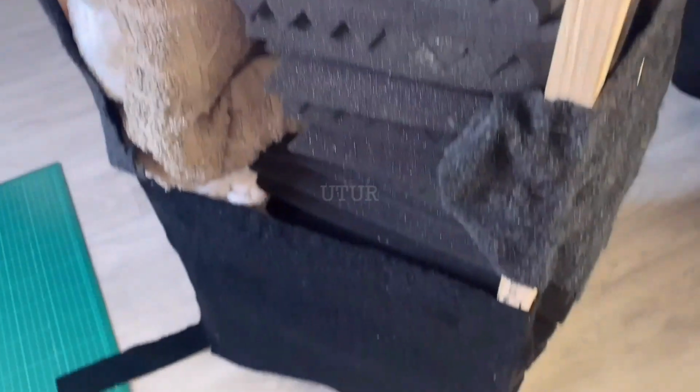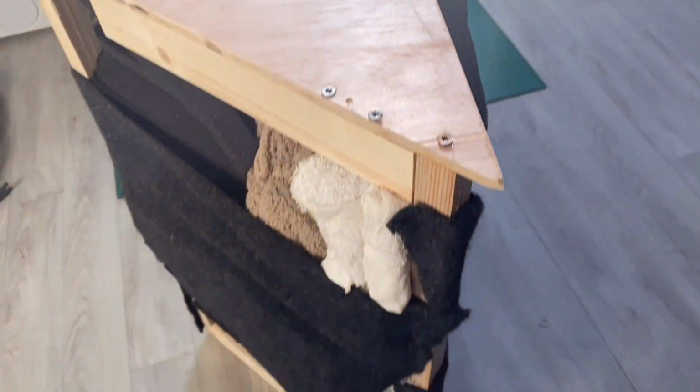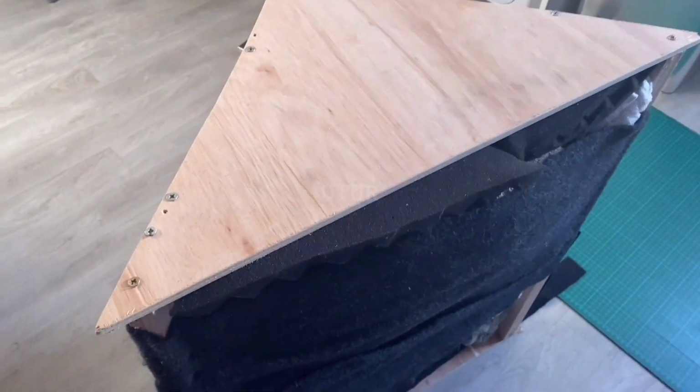And lastly, I've got acoustic pads that have been flipped over on each other and stacked in the BassTrap frame structure. As standalones, these acoustic pads may help slightly with reflections, with mid-range and high frequencies, but not particularly low frequencies, okay? But when stacked on top of each other with towels, acoustic BassTrap remnants and RockWool, they might be quite effective with regards to reflections or low frequencies in a BassTrap.